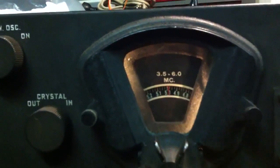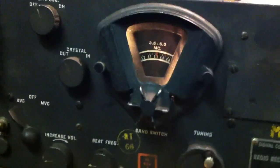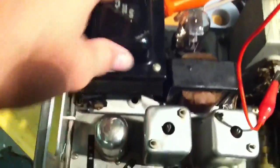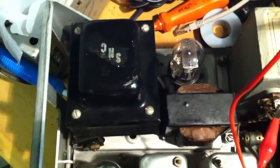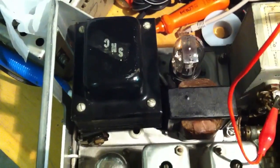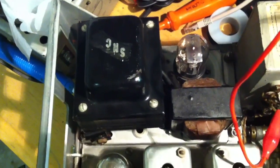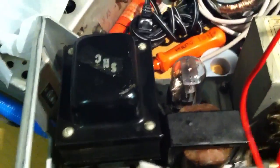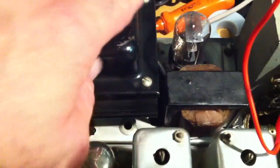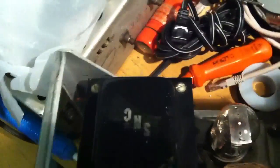When I got the radio, the owner told me that you need some capacitors replacing on the power supply. These radios were originally designed for aircraft, so normally on this little panel there would be a little dynamotor supply to take 28 volts up to 200 volts, whatever it needed. They were typically sold on the surplus market to ham radio operators. This one's already been modified — it's had a power transformer put in, a filter choke, and a 6X5 rectifier. That's what's running the radio right now. I replaced the electrolytics on that, but they're underneath the power supply.